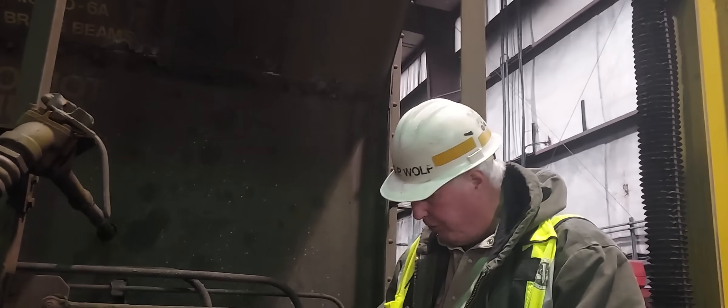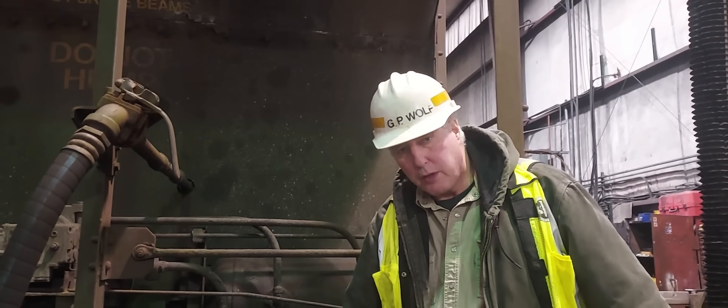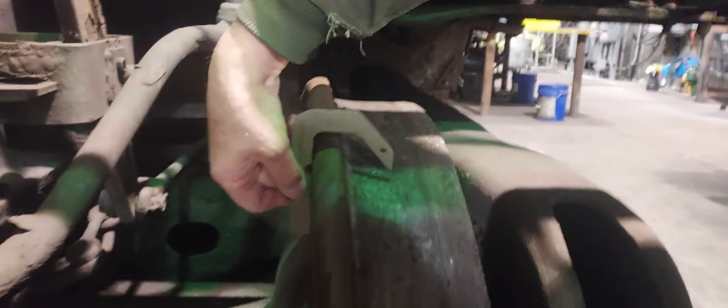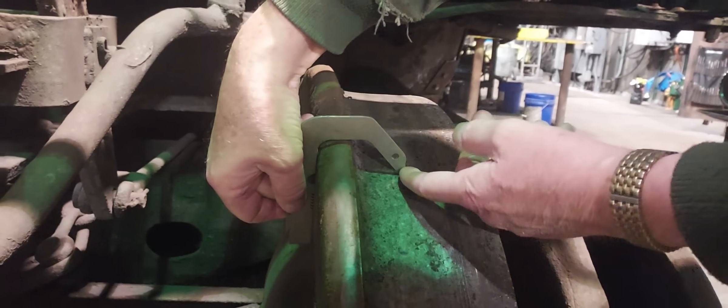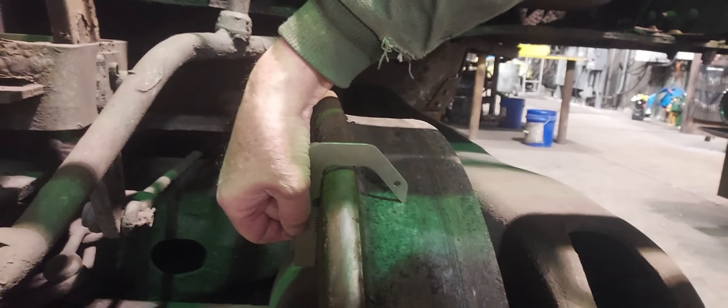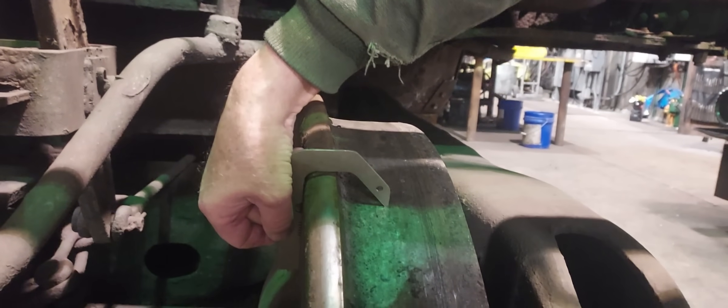You can also measure what is called a high flange wheel — the height of the flange cannot be more than an inch and a half above the tread area. That can occur because the tread wears down. You use the AAR standard wheel gauge, place it on the back rim of the wheel, make sure it's seated, and check it at the tape line. If it touches on the flange and not on the tread, it's a condemnable high flange wheel.